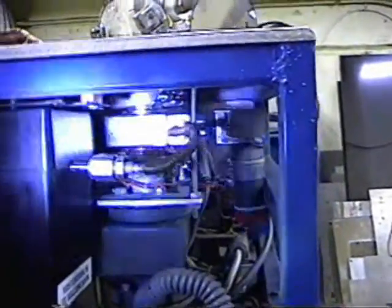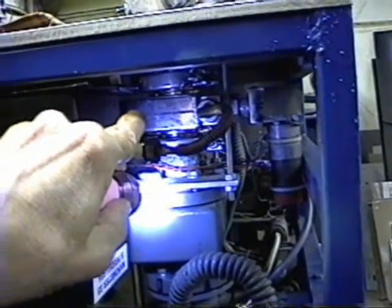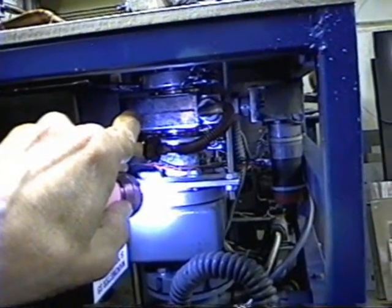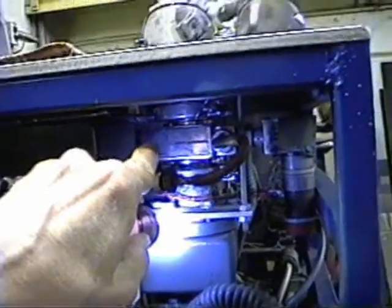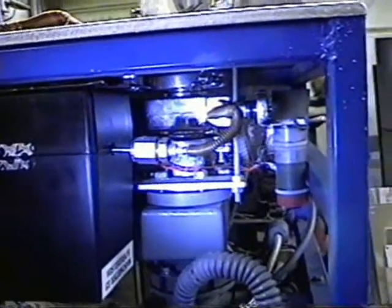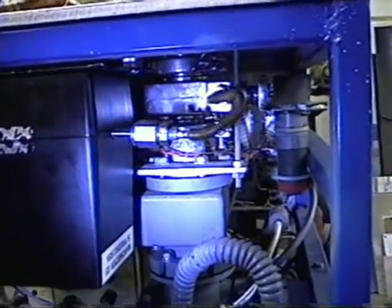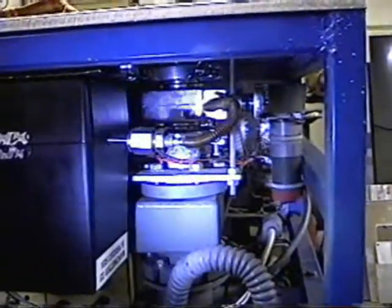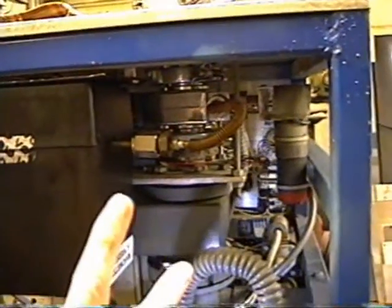On this particular system, I have a shut-off valve. This is the main valve for the input port. This is important because you may not want to shut down the vacuum system when you change from one tube to another, or you may have to take the tube out and do some work on it. If you find that you have a leak in the tube, you'll have to pull the tube off the vacuum, do some glass work on it, and then put it back in. It takes an hour for the vacuum system to stabilize when you fire it up, so you don't want to shut it off, let it cool down, then turn it back on again. By having this valve, you can shut the input port off so that you can remove the tube without turning off the diffusion pump.